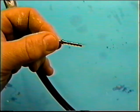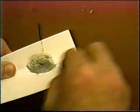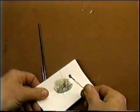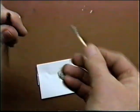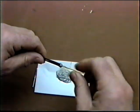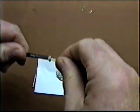Do this. The JB Weld that I like to use, I much prefer the slow drying as opposed to the 5 minute. Anything 5 minute, there's a compromise in strength. I would always want to have the stronger one, especially for a part like this. There are just some parts of a plane that, if you don't have them right, boy, are you in trouble. Now the first thing is I get in there and make sure that's got plenty of goop in there. I don't want to have any dry spots. And that's got the whole thing.